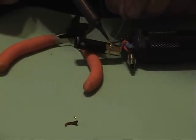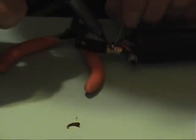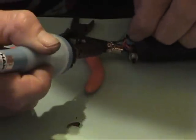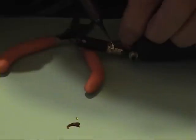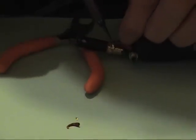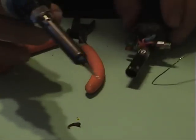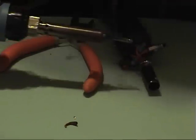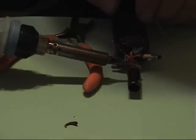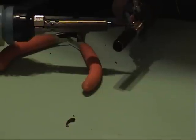This is probably the hardest solder connection you'll make — soldering your negative wire to the outside of the atomizer connector. It's not that hard but it's not that easy. It doesn't have to be pretty; the whole thing is going to be covered in JB Weld in a second. It just has to be connected. And that is connected.